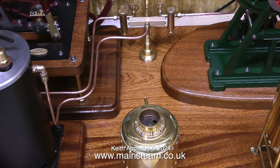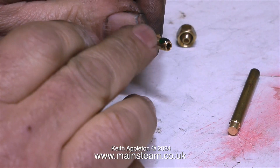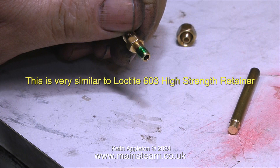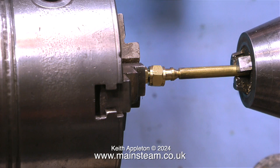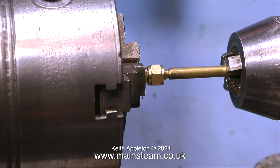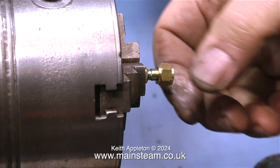On screen is the original steam inlet fitting for the chuff pot, designed to take a piece of silicone rubber tubing, but I need it to accept the T-piece on a commercial union. I've coated it in some Loctite equivalent, and by holding the fitting in the lathe chuck and using a piece of brass bar in the tailstock, I'm pressing the coned union into place on the chuff pot's inlet pipe. Even without the Loctite it's a very tight fit, so it's not going to come off. I then quickly clean off any traces of Loctite so it doesn't stick the nut to the union cone.